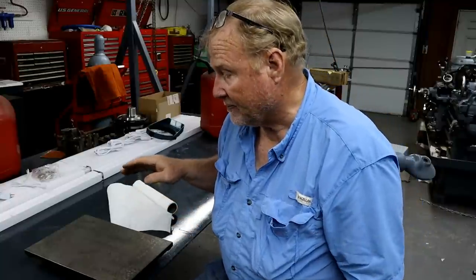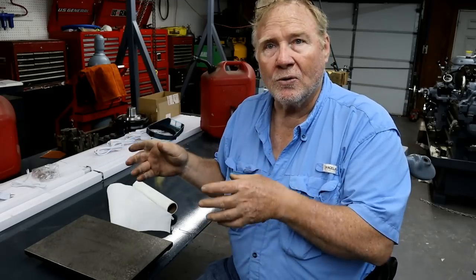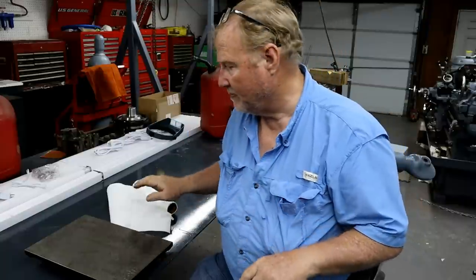Now, in the old days, the really good granite surface plates came with marks where they finished them up on those 3 points, so you knew where to put the marks on your holder. And a lot of the ones I see today are just angle iron tables where you set the stone down inside them, and who knows what you're distorting. They're not even pressure. So always look for a table and a stone that is supported on 3 points.